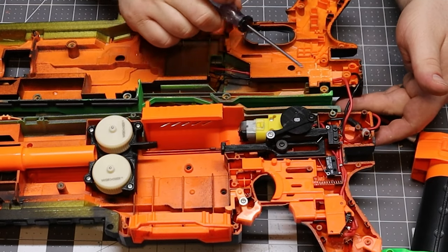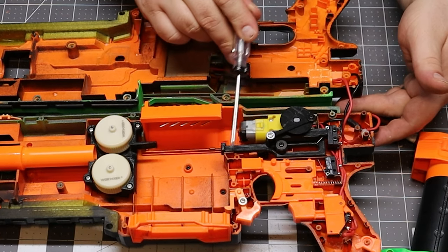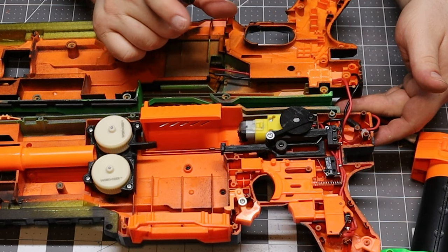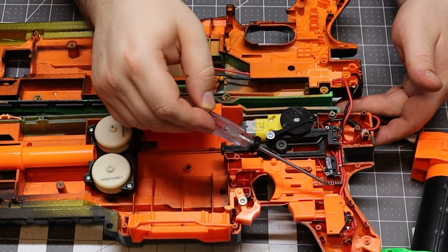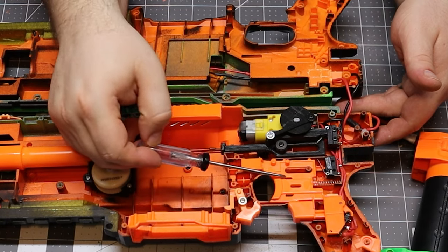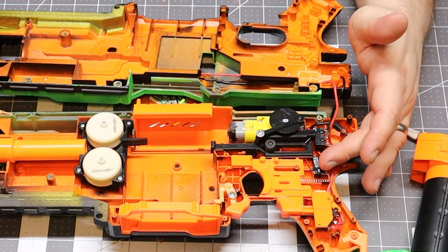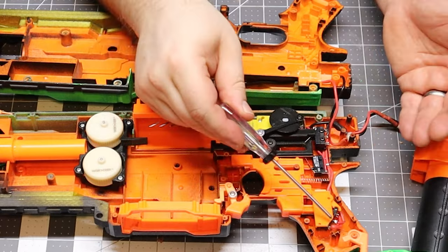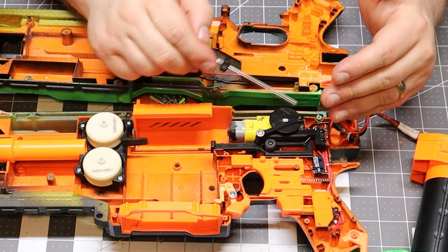The current wiring is essentially a three-switch rapid strike system. We have a return switch here which detects when the pusher is in its fully closed position — this gives more controlled rate of fire, making it easier to pop off one or two shots. Down here we have the rev trigger. I did retain the mechanical trigger lock so you have to be revving to fire. Here's the trigger switch — so this is a three-switch rapid strike system. I'll post a wiring schematic; it's pretty straightforward, just a little hard to describe given how tight the wiring is, but it looks more overwhelming than it actually is.